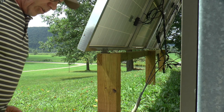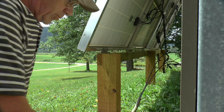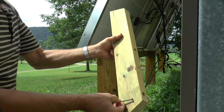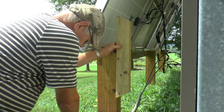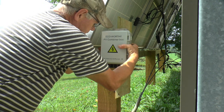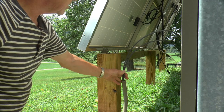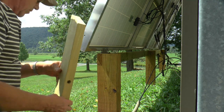Because of where this is at, it's going to be pretty hard to video — I'm probably going to be in the way. The plan is I made this pressure treated 2x4 with a couple of recessed holes here. That's going to go right in that area and then this box is going to mount something like that. What I have going underground is 2 number 6's into the garage. So we'll get this baby mounted up.